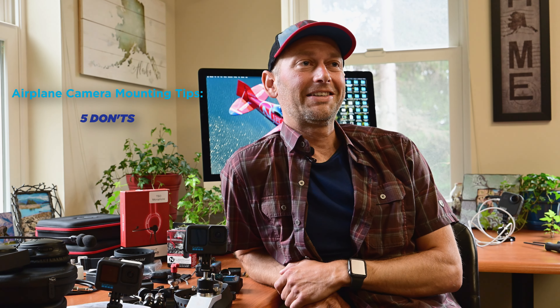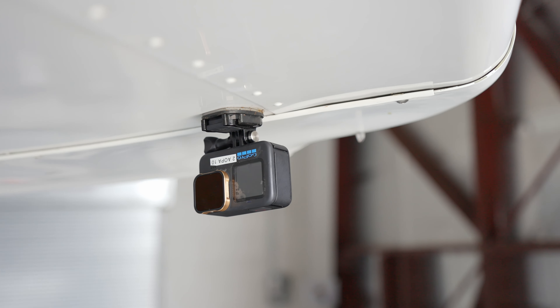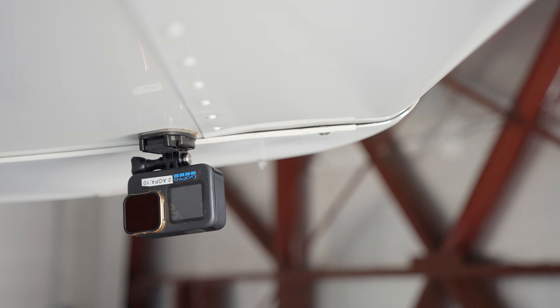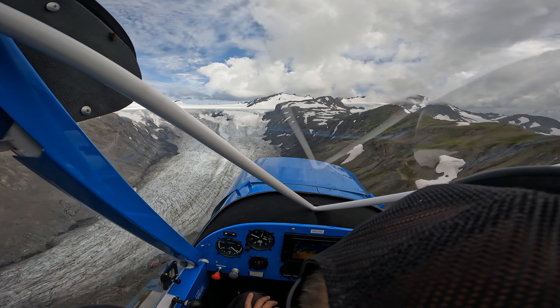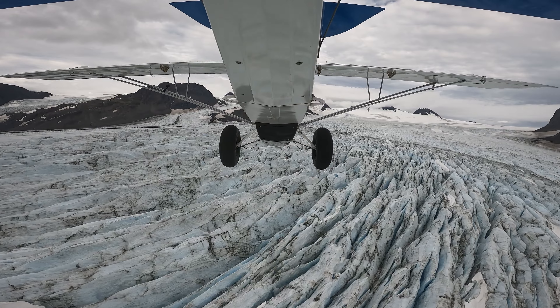All right, top five don'ts. Number one: no sticky mounts outside the airplane. Sticky mounts are great, and 3M VHB — the adhesive they use — is amazing. But outside an airplane we have a couple of issues: one, oil. I haven't seen an airplane yet that doesn't have a little oil on it. Two, temperature. It can get really cold, not even that high up, and that'll cause the VHB to come off at some point.